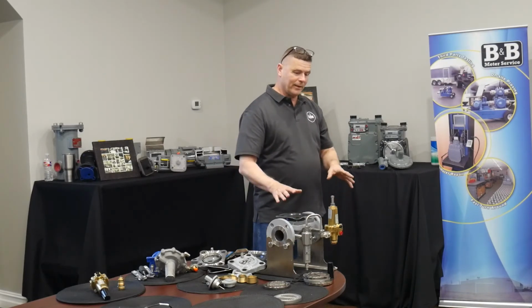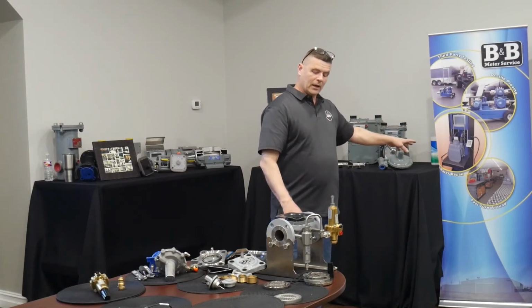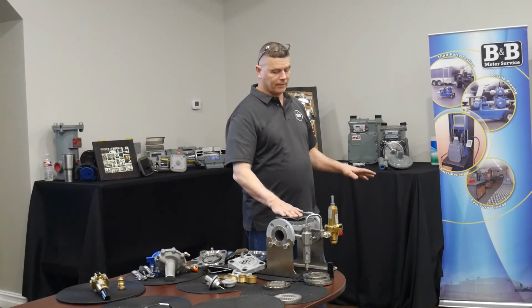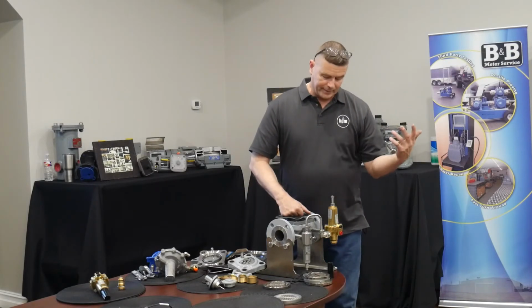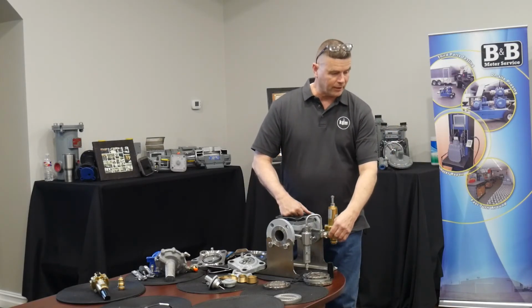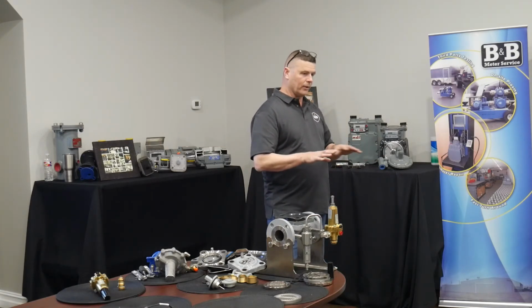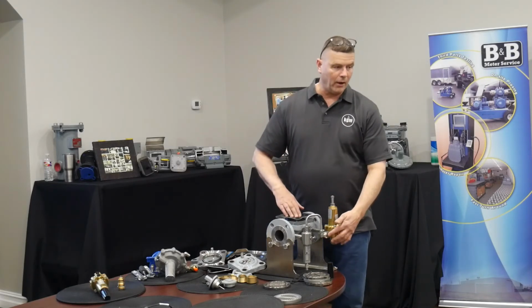But the problem will be then, again, the condition of how quickly it will close. So I've got to decide from a sensitivity or a stability perspective where I want this. Typically in startup, the IOM manual will say put this on a larger number to keep it from cycling while there's gas just loading the downstream system. Most of the time you don't have to mess with this restrictor at all.